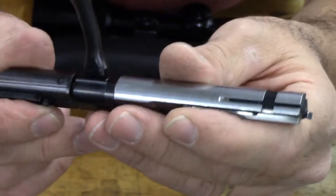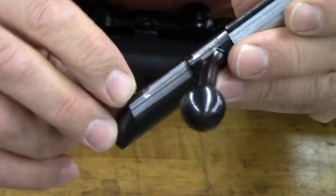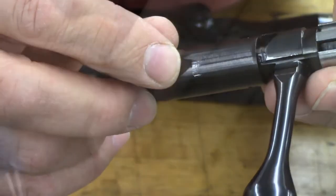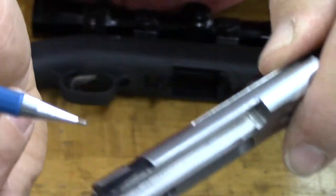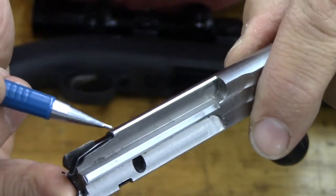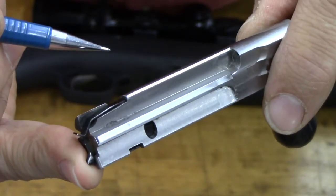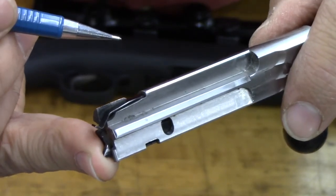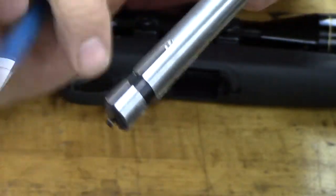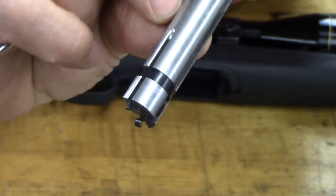As long as I'm looking at burrs and going crazy about burrs, one thing I noticed here on the back shroud of my bolt — there are some scratches, and that's just after a few hundred rounds. I'm also noticing some scratches on the bolt that seem to originate from this corner right here. I can hardly tell there's a burr there, but it's not just burnishing the rifle, it's putting scratches into it. On this edge here, I can sure catch a fingernail on that. I'm going to take that little burr off too.